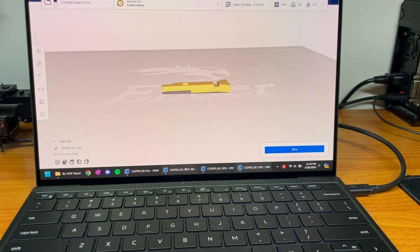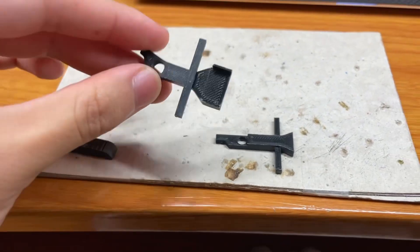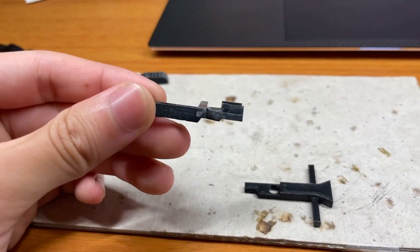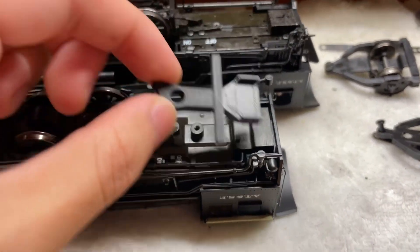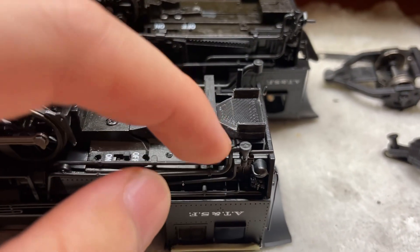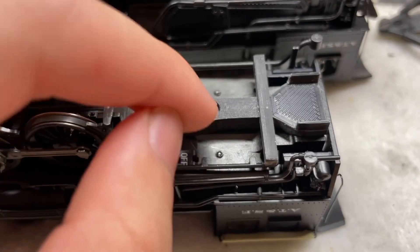Here are some of the 3D models. For the 282, you can see it's three pieces combined together. This thing fits very snugly inside — you can see the complicated curves and shapes. It has a clean fit and is out of the way so it won't impact trailing truck performance. The hole here is snug so the spring will still fit there.